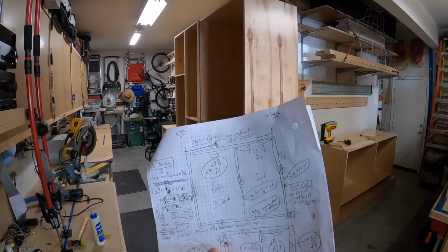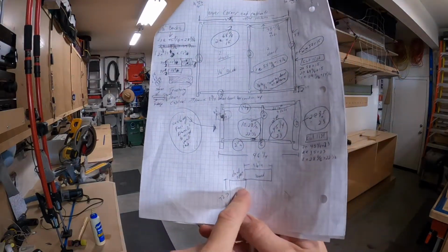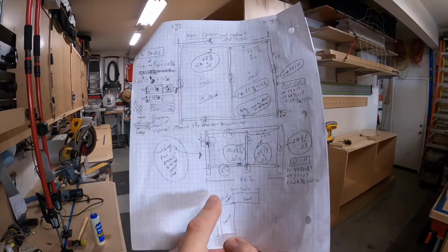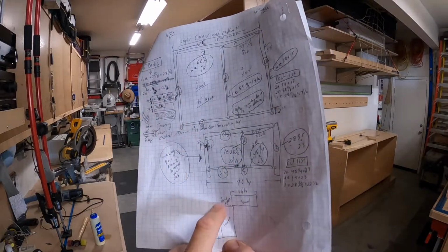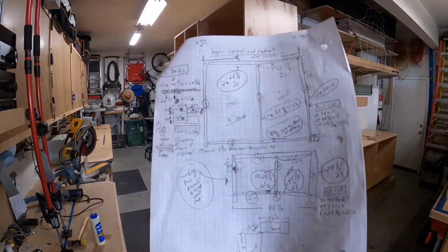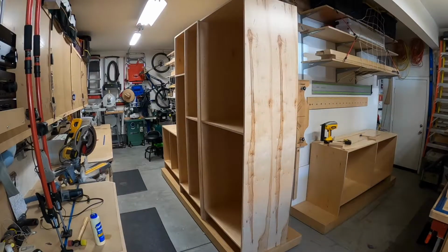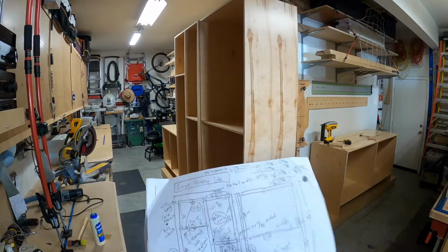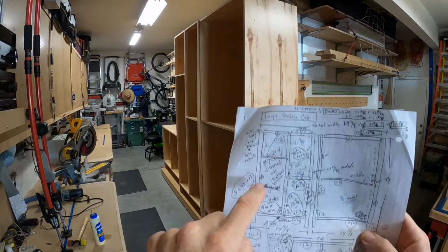4 is actually going to be overhanging to the inside so that when we T-bone these, that's going to go right into it. Since we're going to leave that dead space, we're not going to touch it. And then we're going to put a cleat on the wall that's going to hold the counter. For the other cabinets, we're going with 2s on the top, and we're going, of course, 2s.